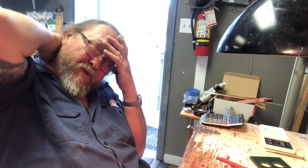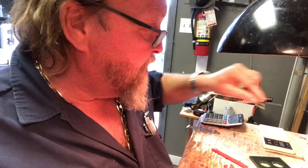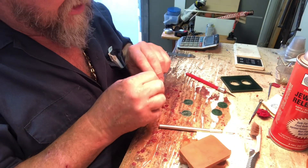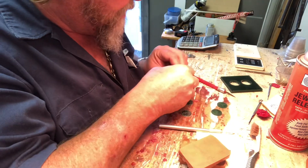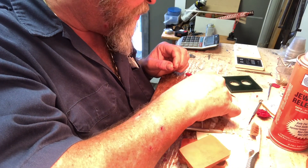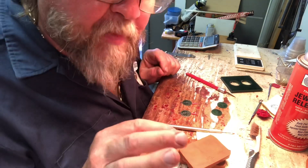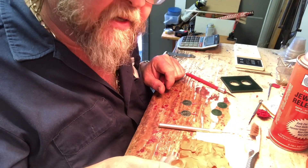When I put this one together it's going to be a 20-minute video. I'm trying to make them about 14-15 minutes - with advertisements they're a half-hour show. Comment to tell me whether you like it or not. I'm going to wax on a little sprue setup on these - cast it from the back, sprue goes there and there. I'll wax those pieces together and put them on a small base with a small flask, weigh them, mark them down on the list, and do the bails to go with them.